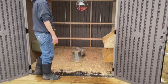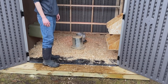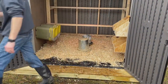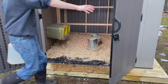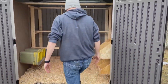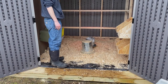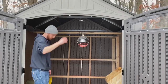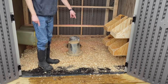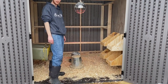If you look down at the base of our coop, we used some eight-by-five-inch posts as our base with some half-inch plywood. My wife and I made that the other day. Then we went ahead and built the entire structure — what you can't see is that it's actually lag-bolted with three-eighths lag bolts to the ground, so it's nice and sturdy on the actual base.